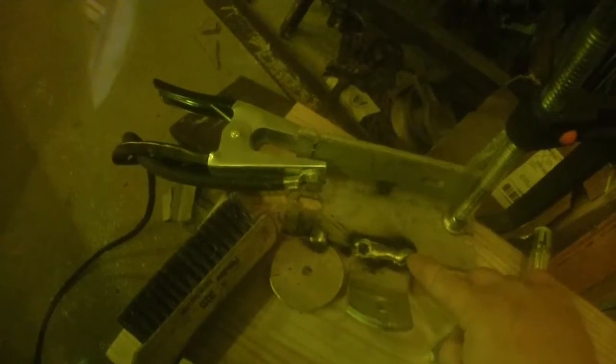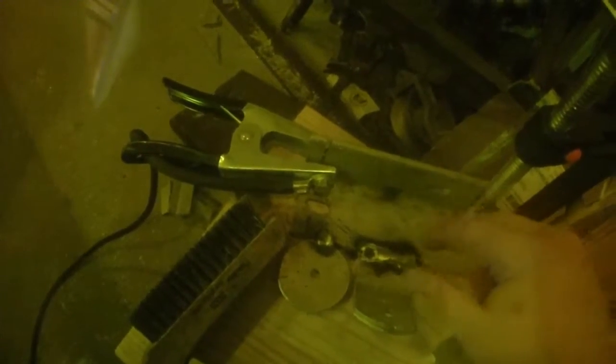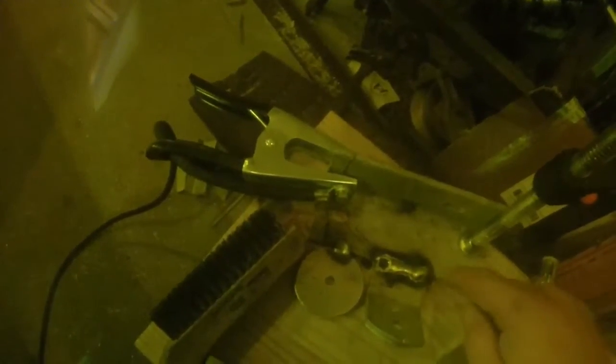As you can see, it was really hard to find that white ring until we got right to the very end, because of heat penetration. Once we got in there, the piece got hotter and it was hot enough to burn the oxidation off. If I were to dissect this weld, you can see how the top of it is actually higher at the start — I went the same speed all the way through, but once you get further in, the weld is actually lower and laying down flat. That means there's more of that weld in the metal than on top of it, so I got a lot better heat penetration. Even on this highly dirty piece, once we got out here, that white ring means all that clean metal is getting so hot that it's burning the oxidation off before we get there to weld it.